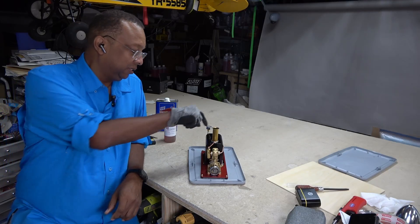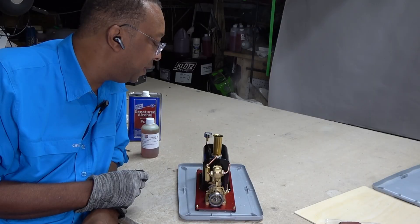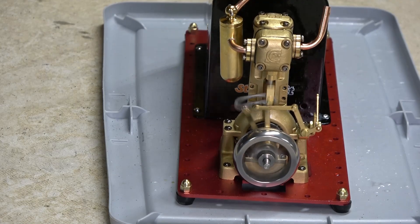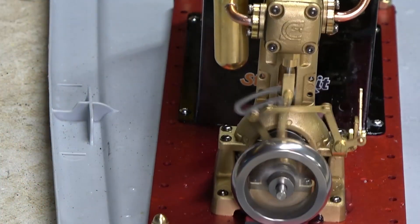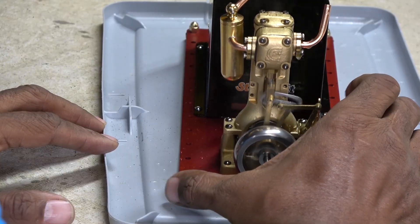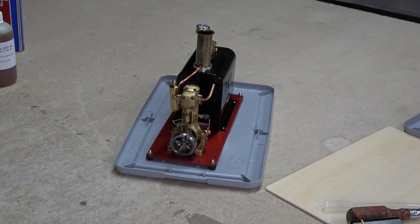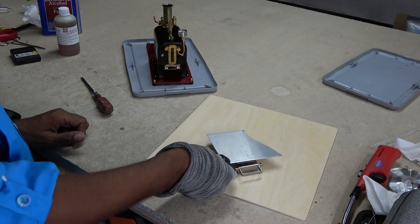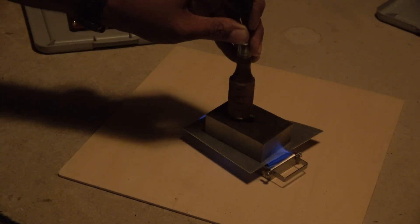I put on my gloves to load it up a bit. It seems to be holding the pressure more or less. After running a bit longer, I could get it to reverse without stalling — mostly. I expect it to get better after breaking in. Eventually I ran out of water and knew the end was near. The manual says to place a strip of metal over the burner to extinguish it. It didn't quite work at first — my piece of metal was too big and needs to fit between the screws — but eventually it went out. Much of the engine wasn't too hot afterwards.